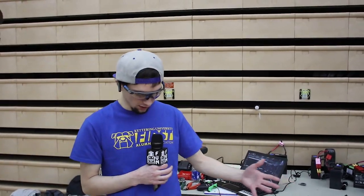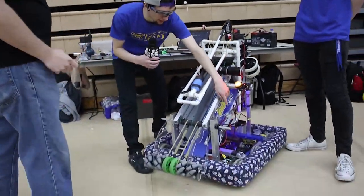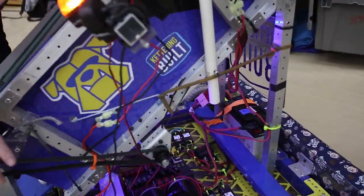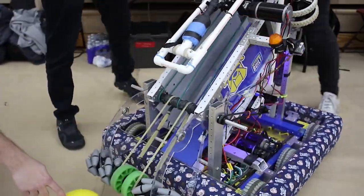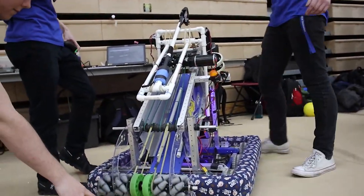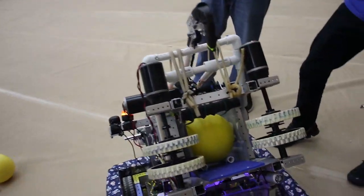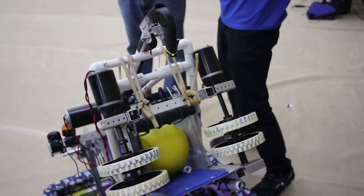Luke can talk about the intake. Going into the indexer, we have a bag motor on an 8-to-1 reduction under our robot that runs a belt to run our indexer all the way through the robot, which then feeds the ball into our shooter — 6-inch high-grip Andy Mark wheels with 1 inch of compression on them. We found that this is very effective. However, we've had some issues with it being a bit powerful, so we started shooting from the side, and that seems to be really good for keeping the balls in the goal.